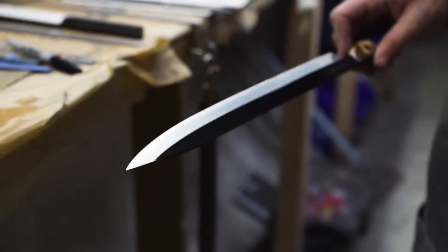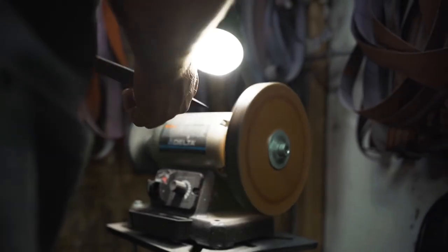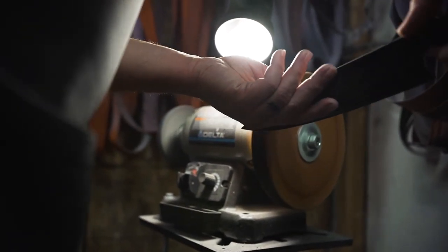As an aggregate, you're trying to find the best hardness — how sharp the blade can get — and the best toughness in terms of durability when encountering these issues. The reason I use American steels is that the PM grade steels I'm using have tougher steels than the Germans at hardnesses equivalent to the Japanese.